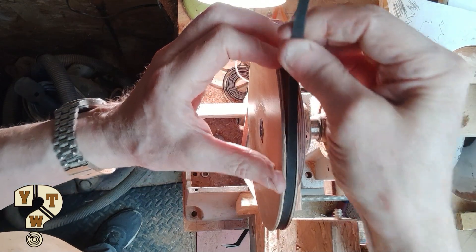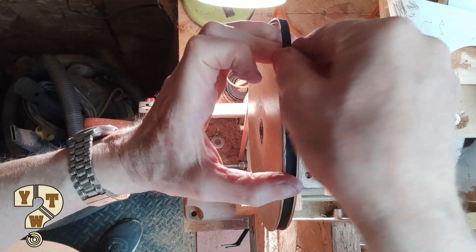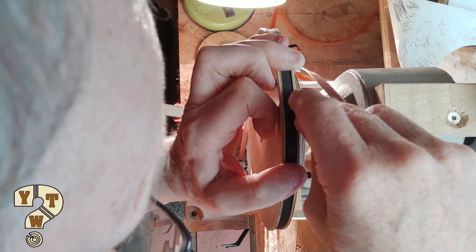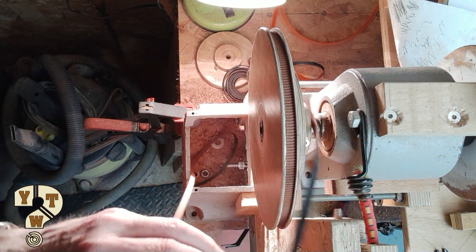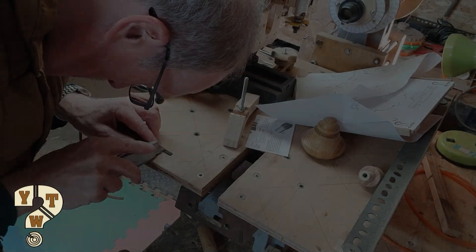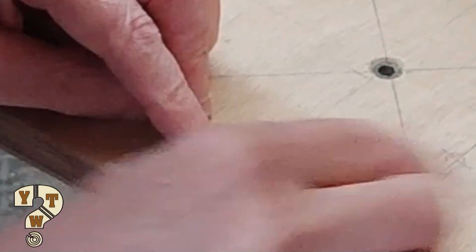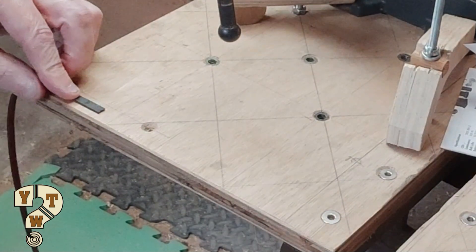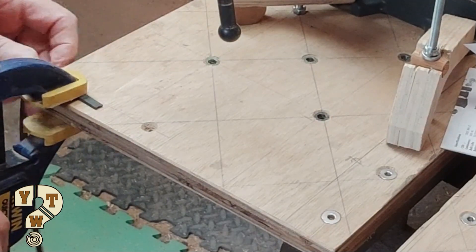It's now time to fit the new drive belt. Here I've got to do a bit of splicing and joining the belt together — this should be interesting. I've marked the belt where the overlap needs to go from both ends. As they join together there needs to be an overlap, but obviously if I just glue one on top of the other it's not going to work.